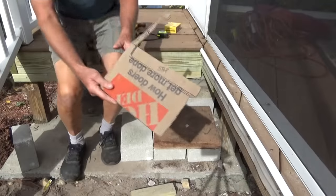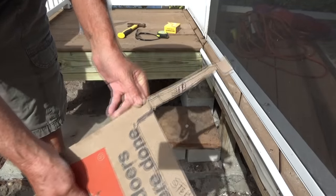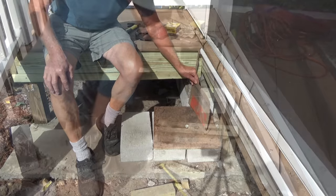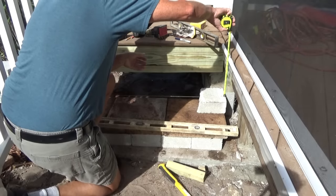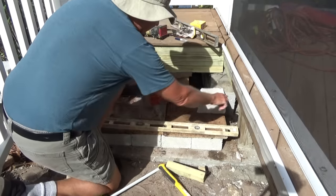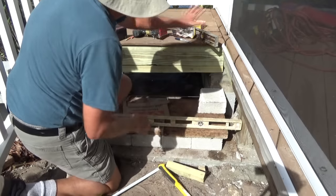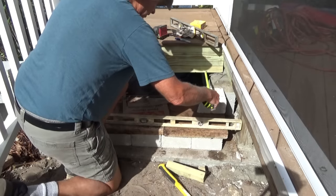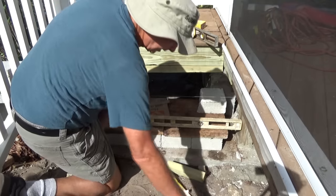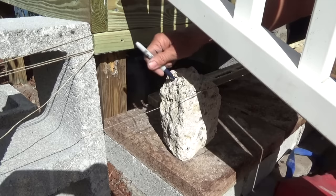This is my step — see that. This is the joint and this right here is the stone. This is the wood on top so when I go right here with it I know exactly what my height is going to be. From the line I gotta make sure I got enough space right here — that's where my step has to go. It's gotta come up to the line with my stone going right across, making sure there's a slight pitch away from the house. My measurements here are eleven and a quarter on each side and I'm ready to go.